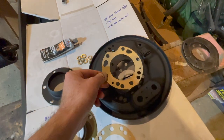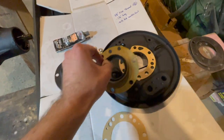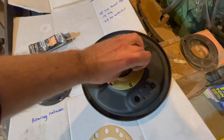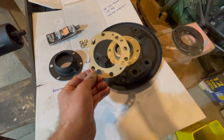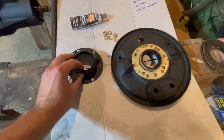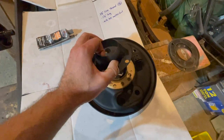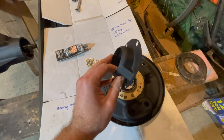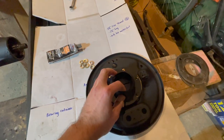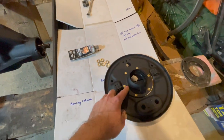The gasket will be installed so the drain hole is at the bottom. Then you have your oil seal on top — make sure your holes are all lined up with your drain hole at the bottom. On top of that will be your next gasket with the drain hole aligned. And on top of that you will put your grease retainer on top, lining all the holes, with the catch part on the grease retainer towards the bottom. Then we'll have our bolts all the way through with the lock washer and we'll torque these to 30 foot-pounds.